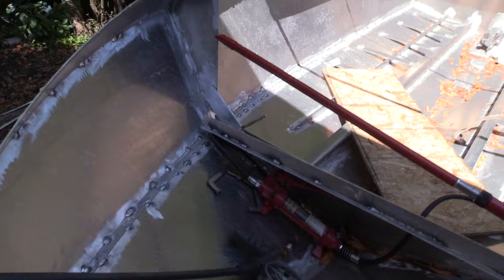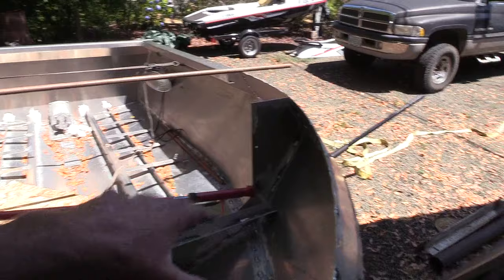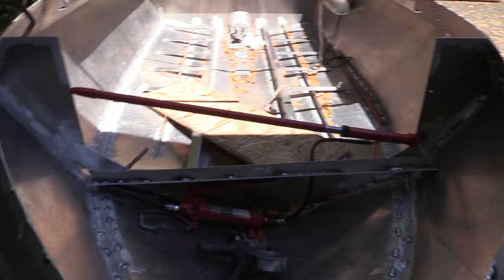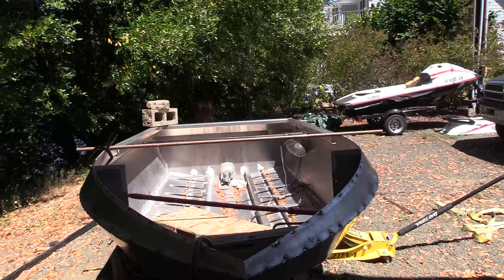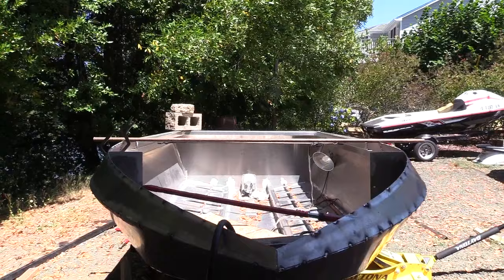And that's why I've used that as kind of a guide and a jig, as I'm correcting for twists and stuff, to just use pieces, get that up in the corner, make those side panels be at an angle that the CNC cutout for the bulkhead was. So I got these side panels in. Right now the twist is down at the bottom. If you can see that, that bar is straight, I've checked it. It's round stock, but it's pretty heavy duty. The back's pretty even, straight and level.